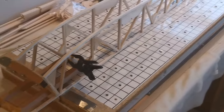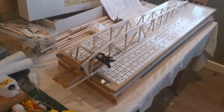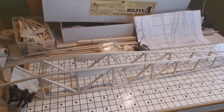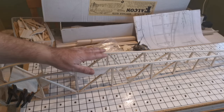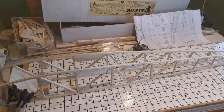There are only two pieces of wood glued in at the moment. The bearers aren't glued in yet and I intend to only glue together the cross braces for the first proportion of the fuselage before it begins to taper in — top and bottom — and I'll let that dry thoroughly before I actually start putting the tapered pieces in as we move down. I'll pause here and start the jigging-up process and then we'll come back to see how it looks.